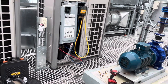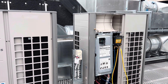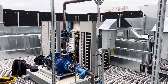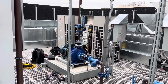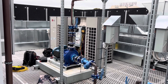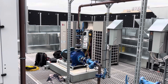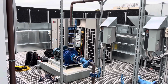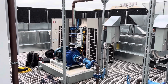Hopefully we'll be able to use the service dongle they have to confirm that we're reading all four indoor units now. The mech boys are still downstairs doing a full fit-out on other things outside the aircon spectrum. I'm going to get them to turn power on downstairs — just waiting for a call. They've got pressure in the system; however, I don't know if they had power to the new indoor or if they readdressed it. So what I might end up doing is getting this thing up and running, readdressing, and seeing if we can get the fourth indoor to communicate, and for this condenser to acknowledge its existence. We'll open up all the valves and do our own separate pressure test with the nitro that's in there.